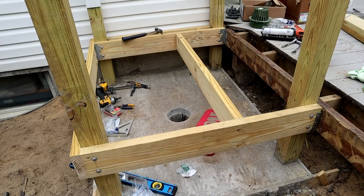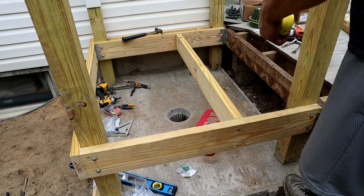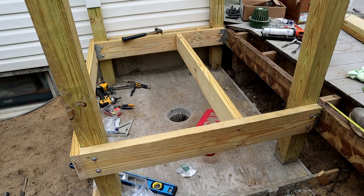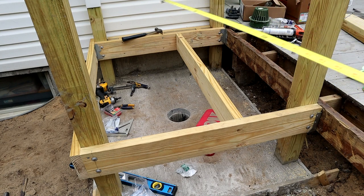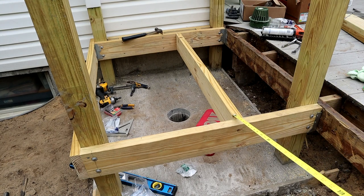After everything was secured I went ahead and added some corner brackets on the inside over here and over here to strengthen everything up. Deck joists are 16 inches on center, just like your traditional house frame. I'm probably going to add some blocking in between these because I've got perimeter deck boards that go around the entire deck, and you have to put perpendicular framing in to support those boards and have something to screw into. So I'll need to add some blocking around the edges to continue the picture frame boards out here.